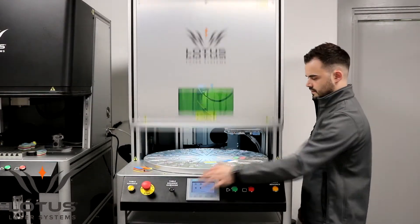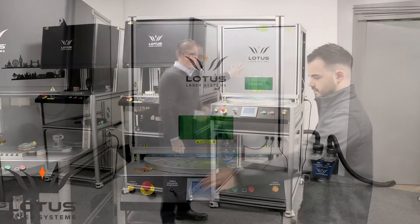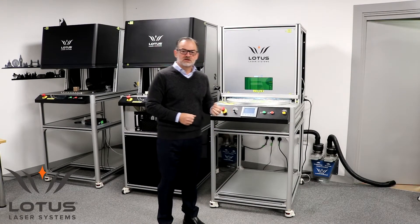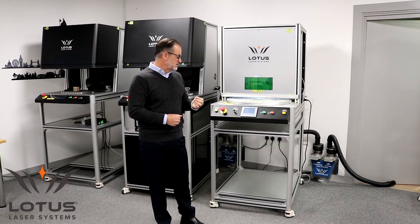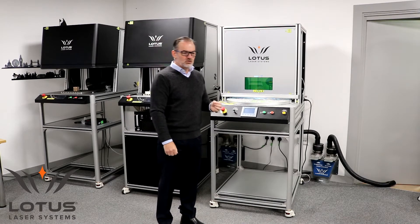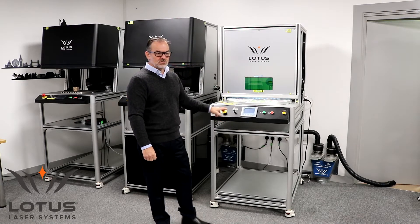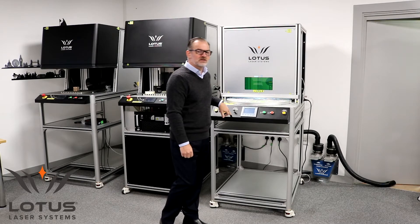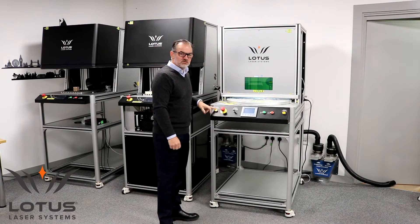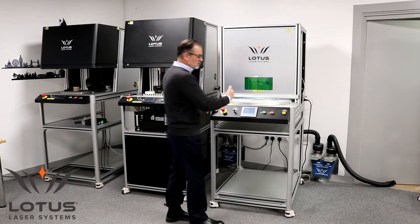For access, we've made this a pneumatic access system. The system is designed with two modes of operation. The first mode is a one-by-one manual operation, which the user would normally use during a set-up or quality control process. It works by two-button activation for safety — the operator presses both buttons and the table will index once.